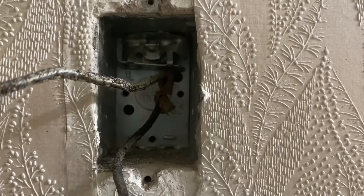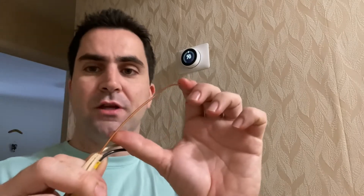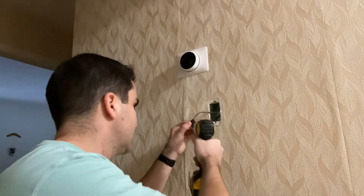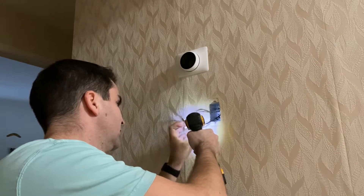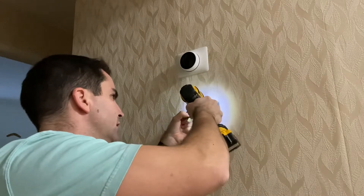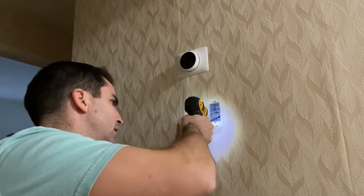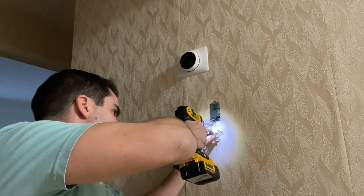What I'm going to do next is use some Romex wire and make a new ground cable. I've got spare electrical wire — I don't need the red and black — so I'm just going to trim away about three inches to make my ground, then bend the end of it and screw it in behind that screw. First I'll detach the existing light switch from the cables. This one has some white on it — old fabric cables — but I'm identifying them, so I'm not worried about keeping them in position.